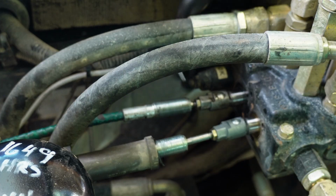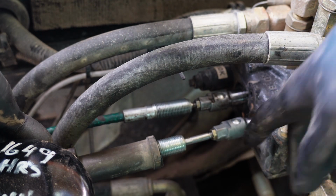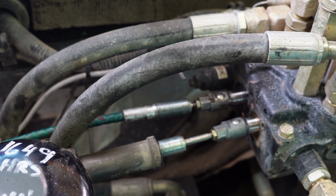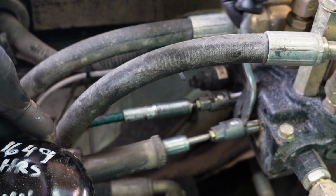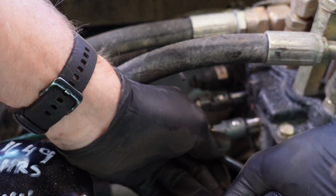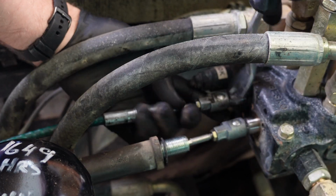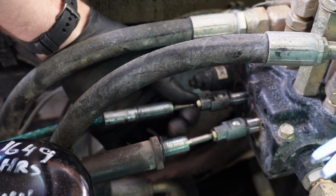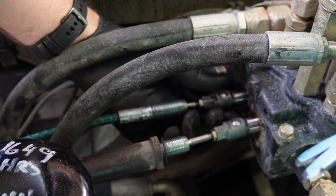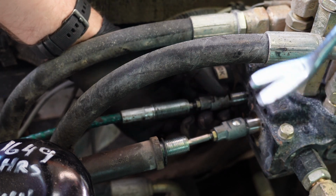Yep, so on the loader up-down valve, this lower one, there's no in and out slop. It's got pressure on it right from the get-go, and it goes right back to its center position. Same thing going in. Yep, whereas this top one, for the bucket, it doesn't center up on its own. And it just, you know, slopping right around there.